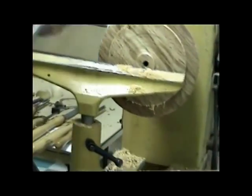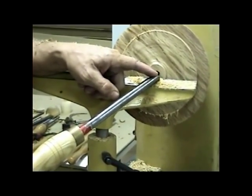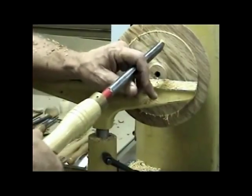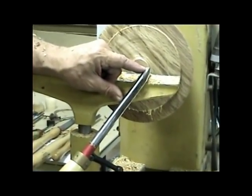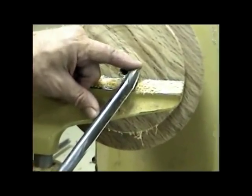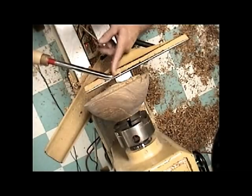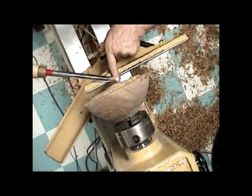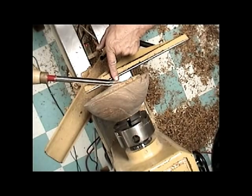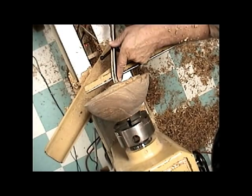Now, to hollow, we have two things. One, this side of the tool hasn't been used yet. So we're hollow and we've got a sharp tool. It's all dull from this side. You can see right here, the tool's still sharp — you can see all that gunk that's built up in the wet wood. What we'll do is have the bottom edge of the bevel pointing straight in, make our entry cut, and bring the tool around so we're cutting right at the bottom center.